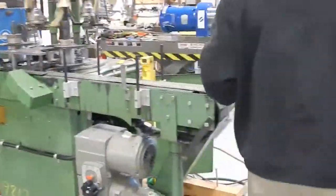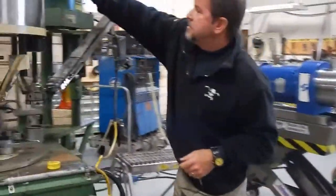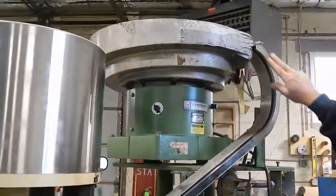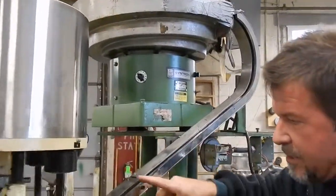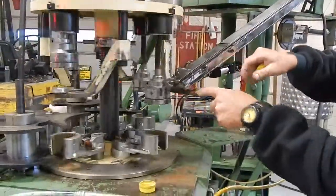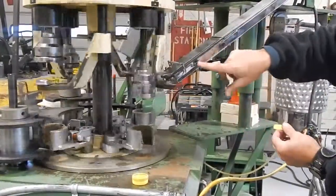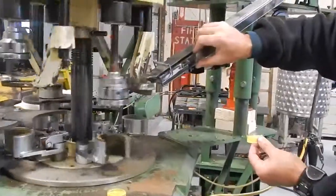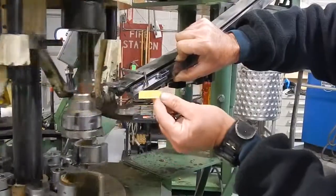One more thing around the back: we're running on 240 volts, three-phase. This is the bowl here — you can crank it up to a really high vibration to continue feeding caps out. This is also adjustable in and out, back and forth, allowing you to position the end of the shoe right where each one of the button arms passes. Also, this is the air cylinder that would actually lift up to keep the machine from getting a cap when needed.